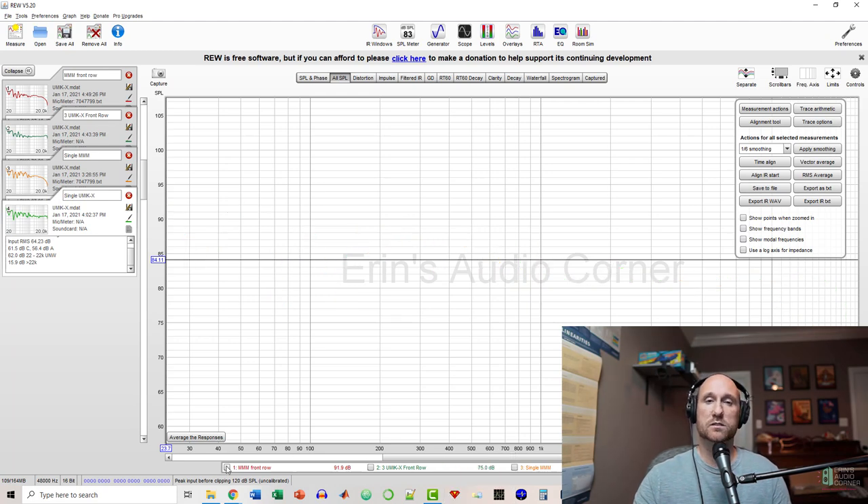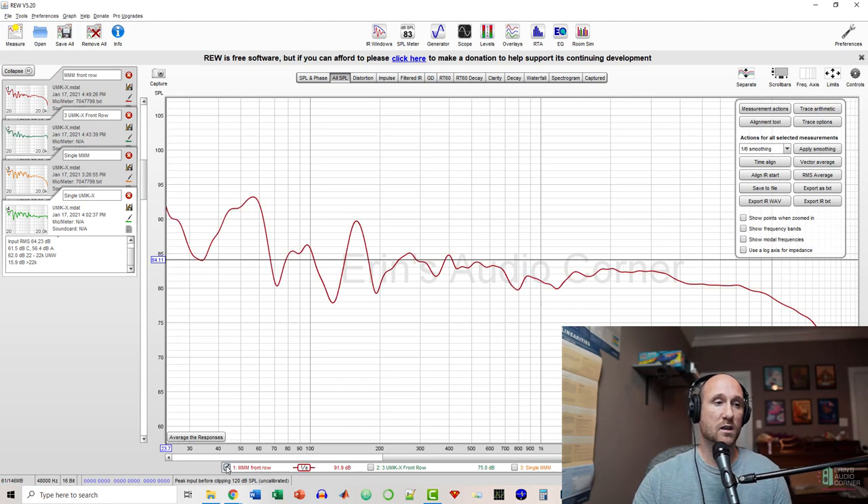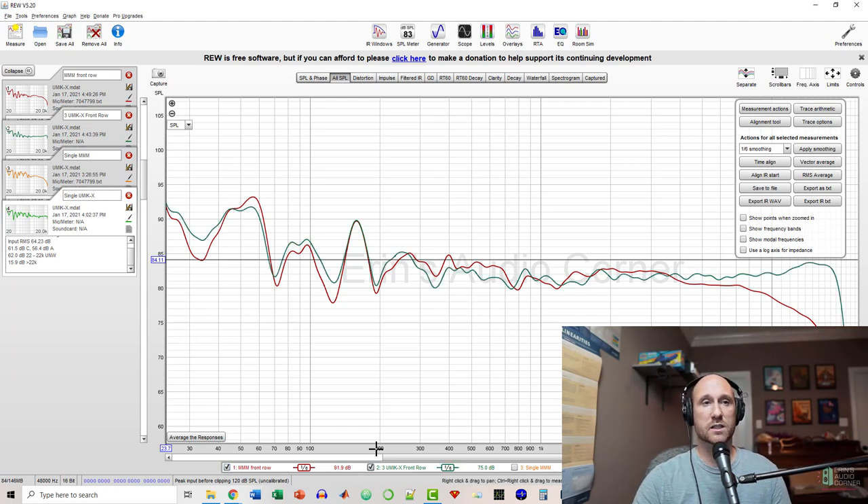We're going to look at the main purpose of the U-Mic X: taking measurements over different seats and getting an arrayed response for each of those seats at the same time. This is the moving microphone method across the entire front row — waving it in each individual seat in a circle pattern and then moving across from one seat to the next. And then this is the three individual U-Mic Xs at the seated position. You can see they line up pretty well, except for the high frequency response. But overall, the U-Mic X is doing a good job in regards to what it's supposed to do.